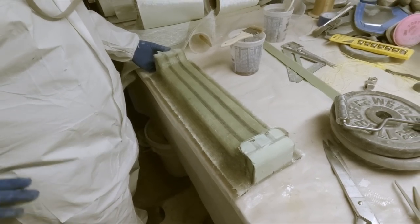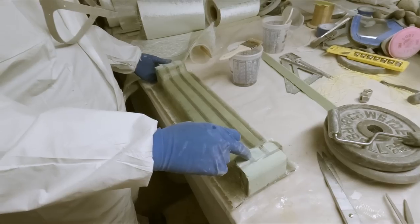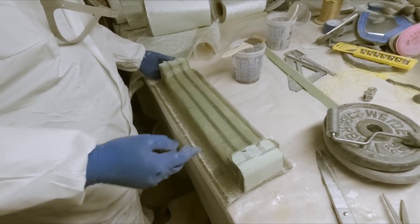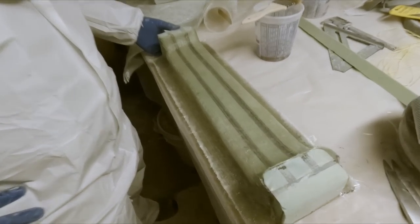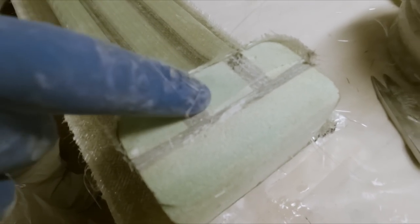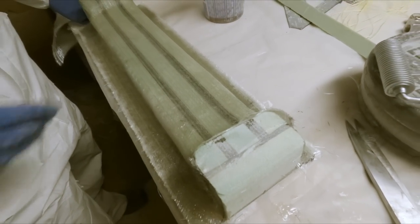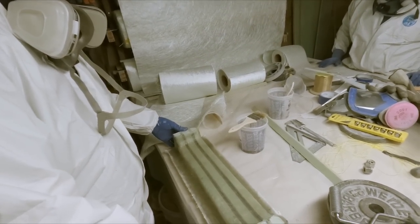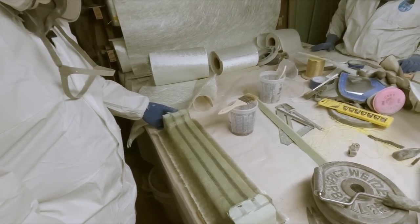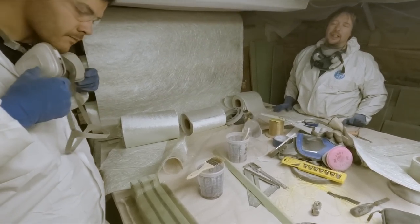So we laid this up yesterday, got all the layers glued together, two webs of basically what we've been using for all of our panels. It's close to a quarter inch on each side of lamination, so nearly a half inch times two for the center web. This will be supporting the bearing block, like you've seen on the other one. So nice and robust. Should carry the load.